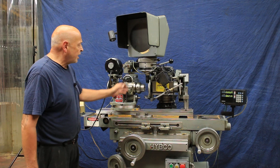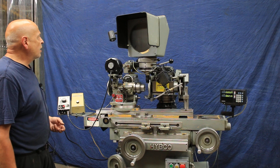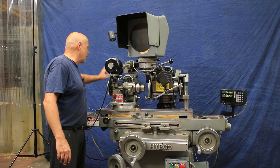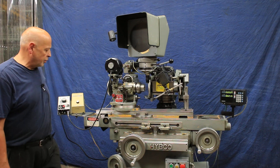The comparator is a nice thing to have. You can inspect your work as you're grinding it — you don't have to remove it from the collet. You could set a little chart up here, and this thing moves around very nicely. It's got a counterweight on the back and you've got actually an X and a Y movement back here with some hand wheels.